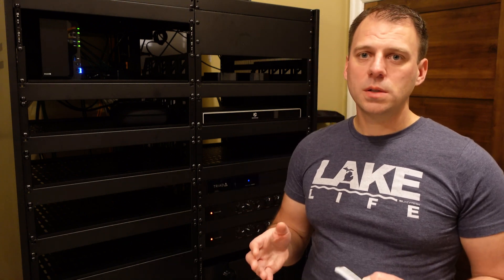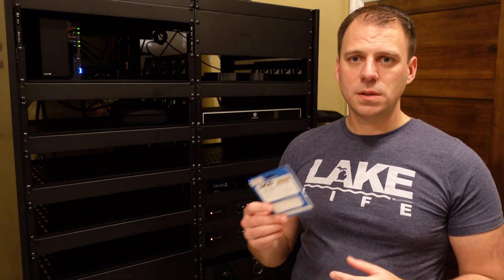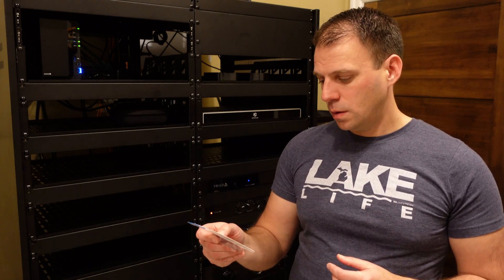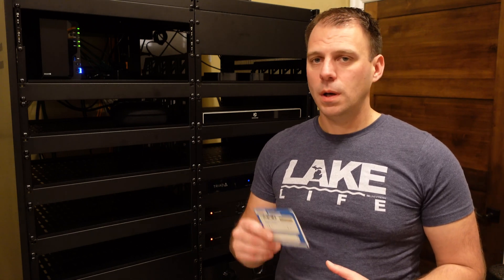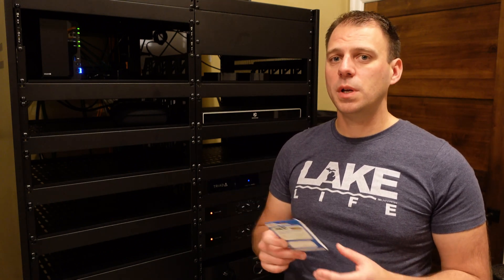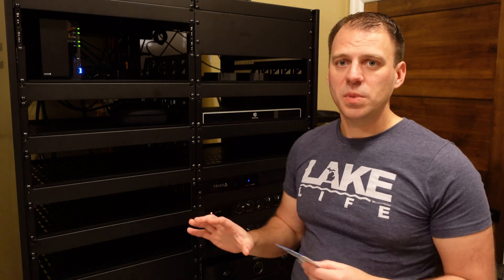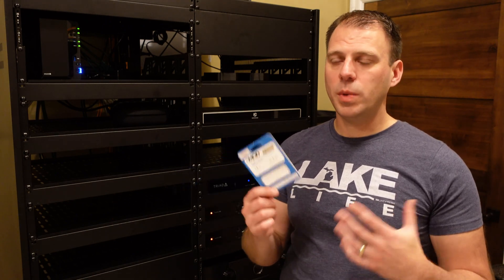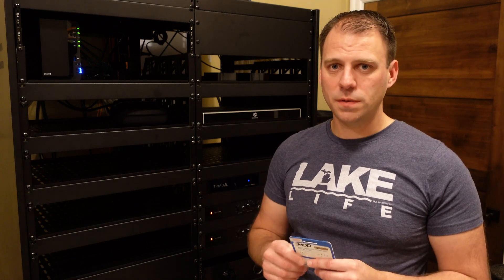Like most crossovers, it's not a hard cutoff — it comes with an electrical slope, so there is a dB roll-off range for how the crossover applies itself to the signal. This is an invaluable piece for tuning that living room and running it properly when you're dealing with amplifiers that don't have those capabilities built in. Bring it in externally — very cheap, good quality, and by all reviews and suggestions it won't color or degrade the signal.